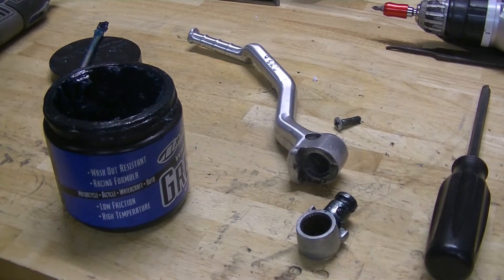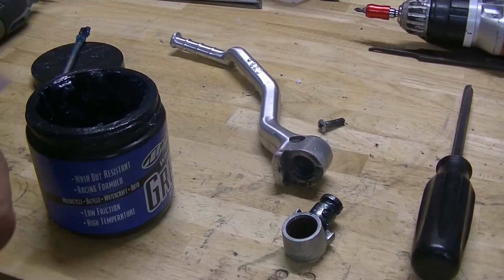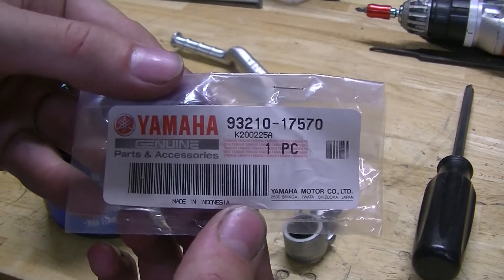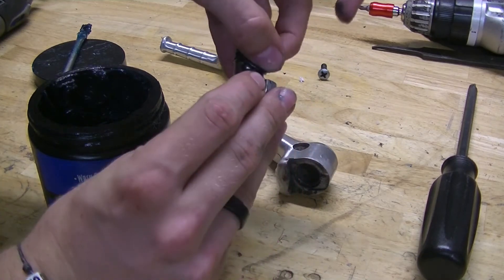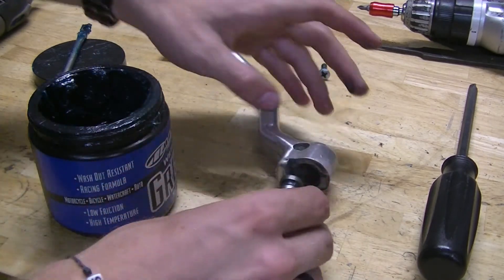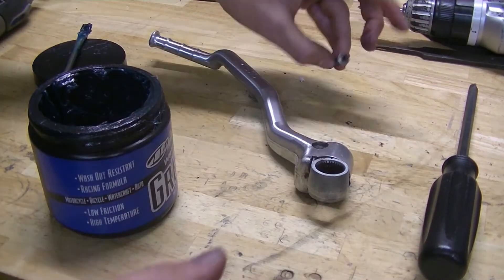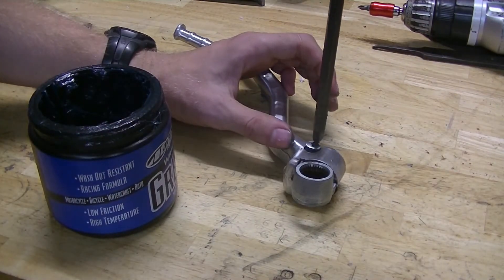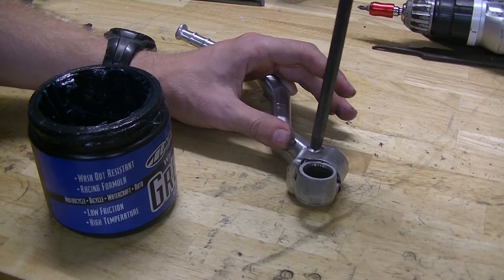The second troubleshoot is the one I have found works the best. What we're gonna do is use this o-ring — there's the part number. This o-ring is gonna slide down all the way around this piece to the bottom like that. You're gonna shove it up in there, take your screw, put it right there, and screw everything back together.